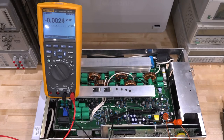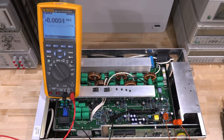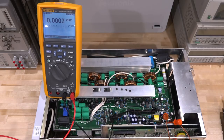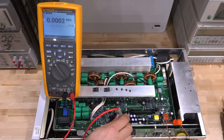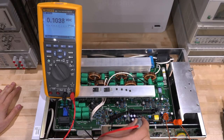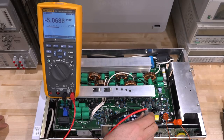I received the parts from Digi-Key and decided to change all four op-amps - even the one that wasn't heating up - so they're all matched from the same batch. I also replaced the 7805 and 7905 - the plus and minus 5 volt regulators - because they had aged, and as you saw the negative one wasn't very good at all. I've bypassed the ribbon cable again, only powering the DC-DC converter here from the voltage coming from the bottom, to verify the supplies are accurate. Here we go: 5 volts - the 7805 replacement is working. And the 7905: minus 5 volts. We've got a very nice symmetric plus or minus 5 volts with the brand new parts.